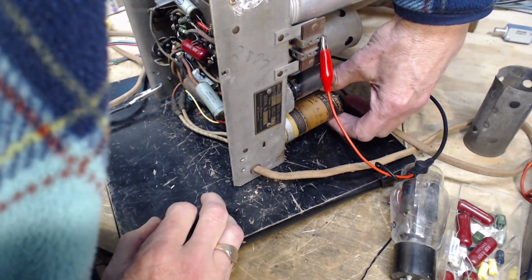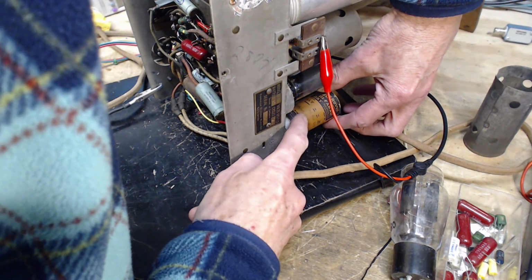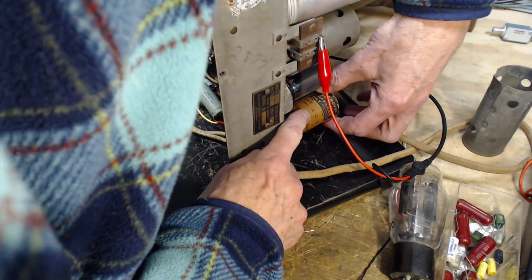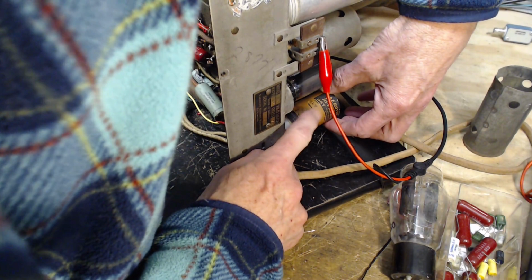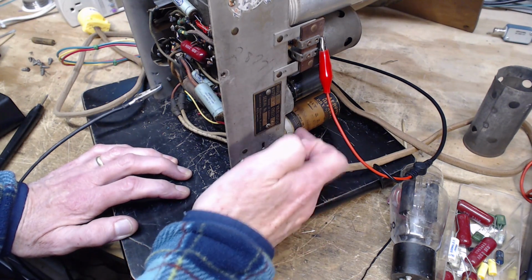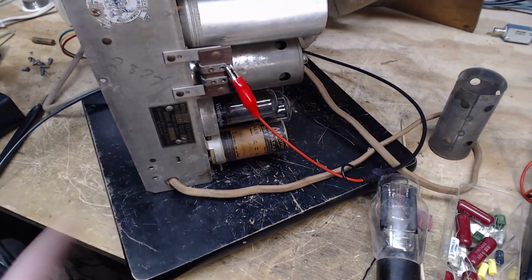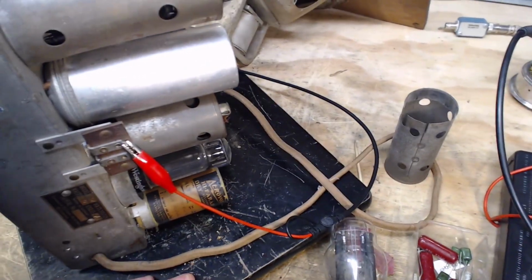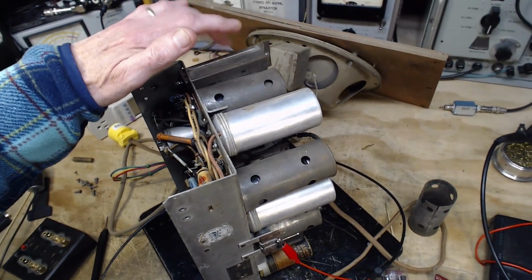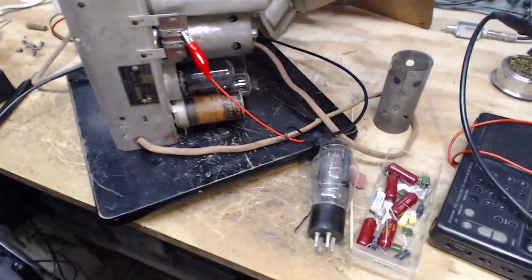This is the high farad dry electrolytic condenser. You can slide that right off. Black is negative. So it's just one capacitor. This is a 20 microfarads, but there's no 20 microfarad capacitor called for in this radio. But this has got to be an original capacitor here. Am I stupid? Is there another one on here I somehow blanked out on? I don't think so. Oh, so we have the big metal can here. Maybe these are the two. Maybe these are the two fours. The two fours. Hey, that's a special thing in Canada. 2-4.